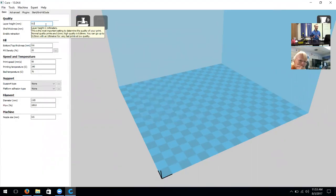It's going to pull me into the environment and I want to change most of these settings on the basic settings. Here at the layer height — the layer height is basically your resolution, or how clean the outside look of your model will be. If you use 0.1 that's 100 microns and it's going to look nicer, but it takes more plastic and more time. We use anywhere from 0.1 to 0.3 millimeters in layer height.